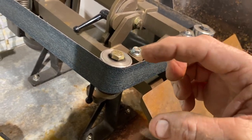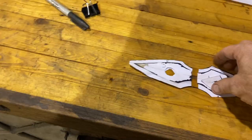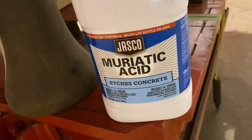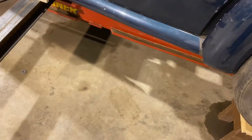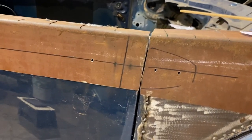I've got the barrel cut out and, just like these pieces of metal, it's black with all this mill scale on it — it just looks horrible. Then I soaked them in muriatic acid — regular old run-of-the-mill muriatic acid — poured some in a plastic cup and soaked them. Then I came over here and had them drilled.